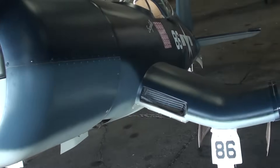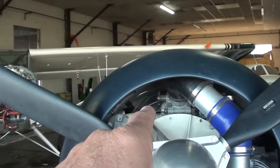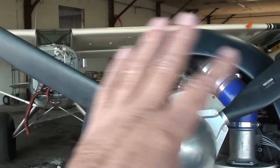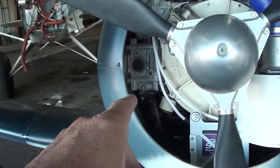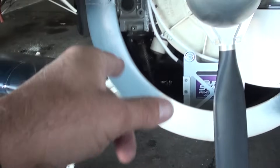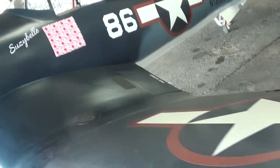Today I bought a new thermostat, came down, tore the cowling off, and fixed that. I tightened the belt — the belt was really loose, had probably stretched in. There was a lot of belt dust on the firewall back there, but the belt's in good condition. I pulled the thermostat and switched it out — it's down there in the back, wasn't that hard to get to, just had to wait for it to drain. Got a little bit of water on the ground but that's all I lost. I topped it all back off, left the cowling off, and checked for leaks.